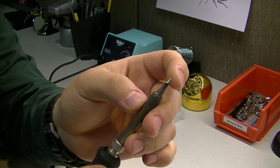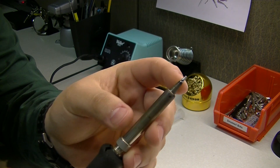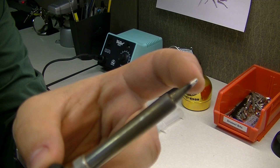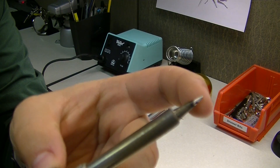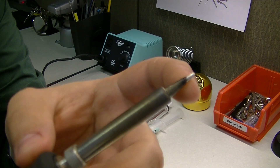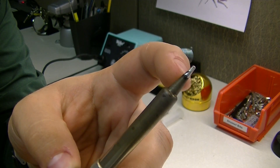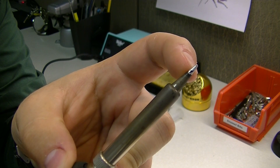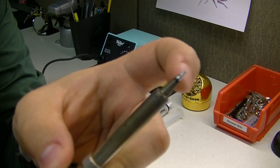This ensures that any oxidation or corrosion will contaminate the solder before the actual tip. Another benefit is that tinning the tip can actually clean it over time. As you can see, this iron has some brown contaminants towards the bottom — this whole tip used to be that same color. Only after I started tinning did I realize that the flux inside the solder, in conjunction with heat and a wet sponge, was gradually cleaning the tip. However, some spots are more stubborn, in which case you might want to use steel wool.